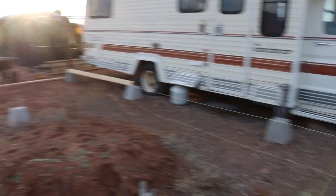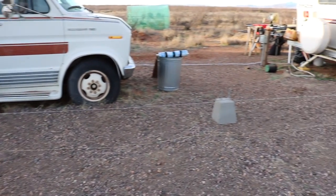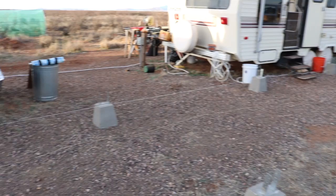It's the morning time. I got my blocks laid out and Jessica and I — we got up at the crack of dawn and got out here. We want to make a lot of progress ASAP. We're running string across all four corners trying to get that 90 degrees, trying to square this up. We got a line running across the back and I've already repositioned some of these piers to meet that line.